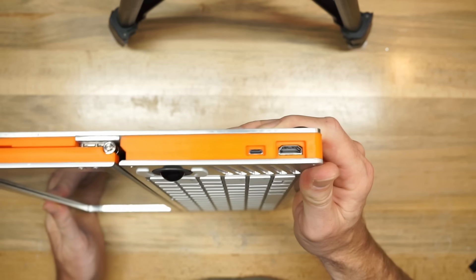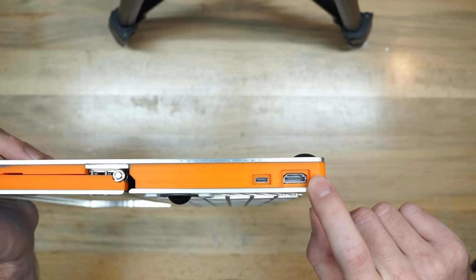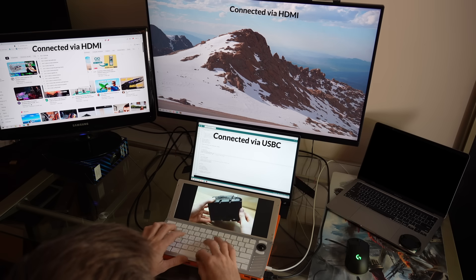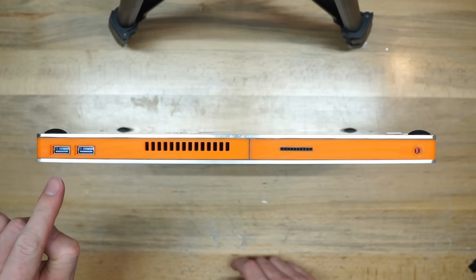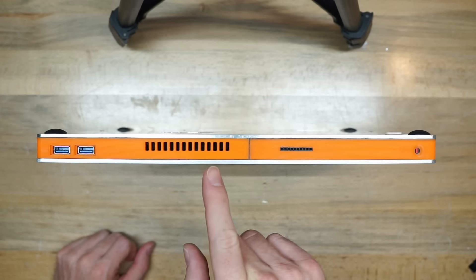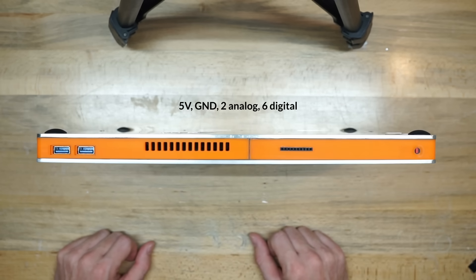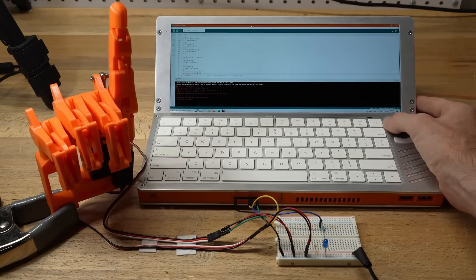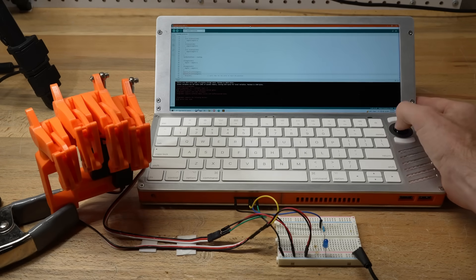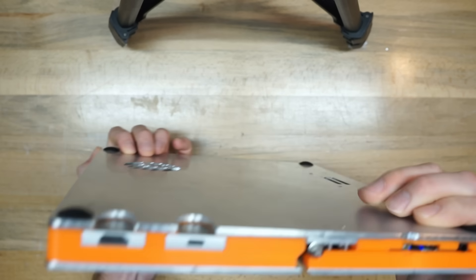On the right side there's a USB-C port — power only — and an HDMI port that's limited to 4K at 30Hz or 1080p at 60Hz. You can still get full performance by plugging an HDMI or DisplayPort adapter into one of the expansion card slots. On the front are two USB-A 3.0 slots, an exhaust vent for the CPU fan, and the main power switch. There's also a row of female header pins connected to the Arduino, providing 5 volts, ground, two analog pins, and six digital pins — great for quick circuit testing without digging through a parts bin.